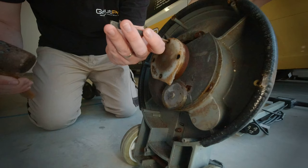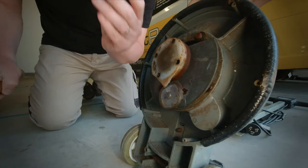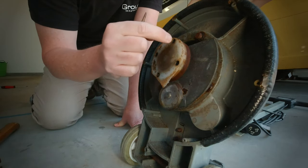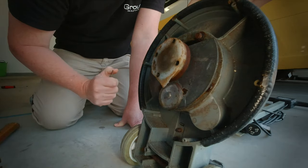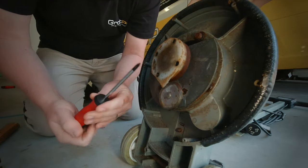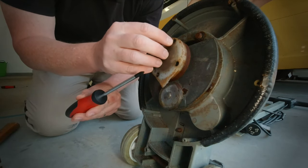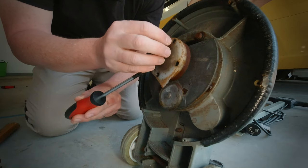What you want to do is locate the centre of the screw and give it a light tap. You want to be careful that you don't damage the head of the screw in doing this. My centre punch probably could be a little bit finer to fit in the hole, however I did a quick test and it worked on the first screw. Now there are different size Phillips heads — you want to pick the screwdriver which fits correctly and seats into the screw so you don't have any slop and you're not going to tear the head apart as you're trying to loosen it.